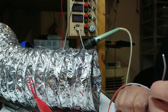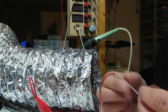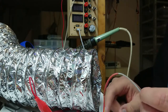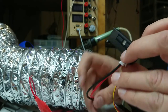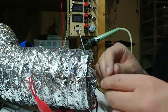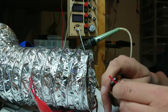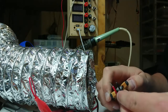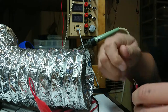I'm not sure what I can do with the negative wire — it picks up off the shunt, so I guess I don't need it. I'll cut this to length and strip that one wire off. It comes off the fuse block too, so I might not need to hide a fuse there. Although if it's running a common negative, there could be a ground loop, so I'll add fuses on both just to be sure and hide them inside heat shrink. I need to tin these ends, trim them, and add a suitable amount that I can fit under the screw block.